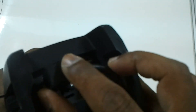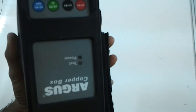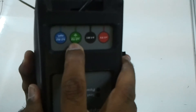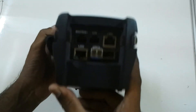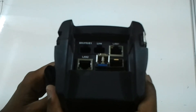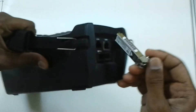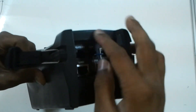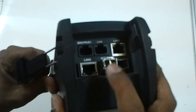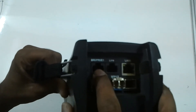You can also connect headphones. This USB cable connects to the copper box device at the back side of the Argus. You can see the tip, ring, and ground connections. On the other end of the Argus there is a LAN port and two SFP ports for fiber connectivity. There is also LAN 2 and a line port where you can test special circuits, leased lines, BRI, and E1-type circuits.